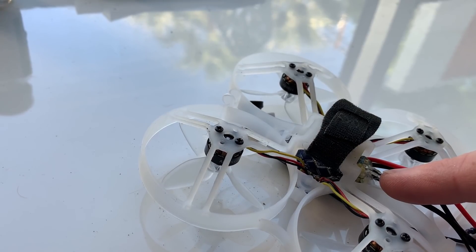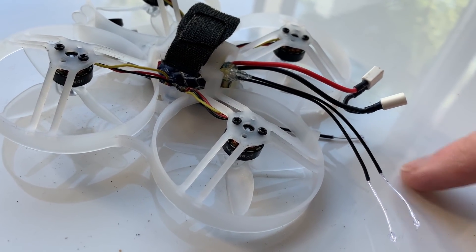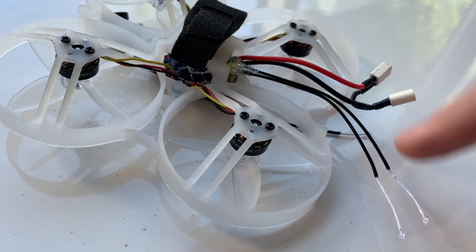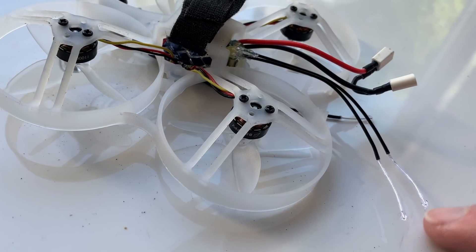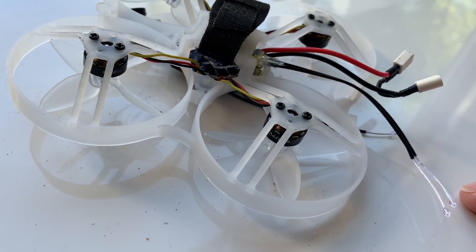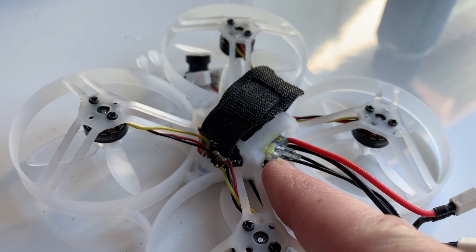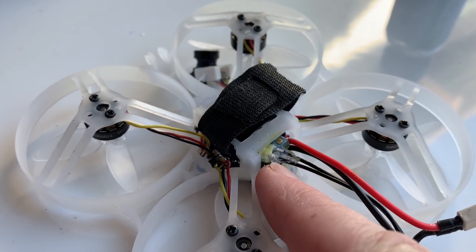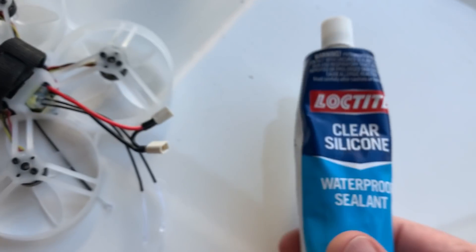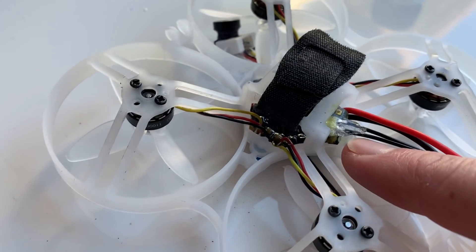The receiver in here is an XM Plus receiver, and I did that so that I would have two antennas. I know sometimes I lose signal when these antennas go in the water, so with two of them my idea is I can have at least one pointing up and one pointing down. They're just coming out the end right now. I've got a dab of silicone on the end of these as well, so the entire antenna is sealed — no part of it should touch the water. I've got conformal coating on the XM Plus receiver, but I didn't want to put that on the IPX connectors for the antennas because conformal coating can get right into connectors and ruin them. Instead, this clear goop is actually just clear silicone — the kind of stuff you'd use to seal up an aquarium or a bathtub.